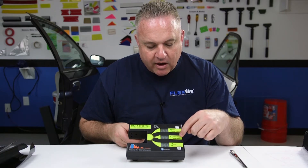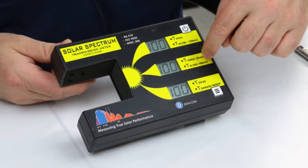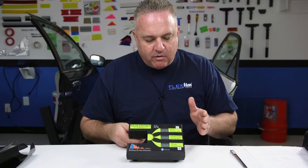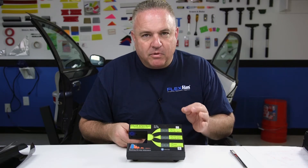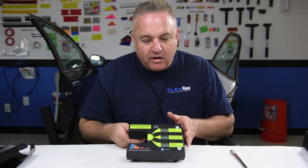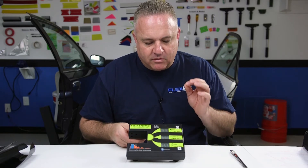The second window is another IR number. You can measure IR between 900 and 1,000 nanometers, or you can measure it broad spectrum between 780 and 1,700 nanometers. It would be nice if this meter went out to 2,500, but it would cost so much money to get that far out, and it's such a small percentage of the actual value — maybe about one or two percent off at the most. But for the money, you can take these numbers to the bank on any window film. It's so close — it may be off one percent at the most.